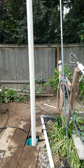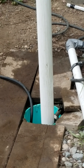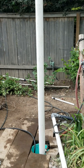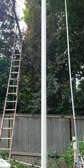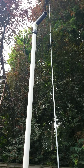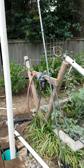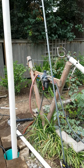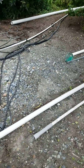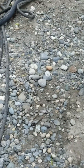So this is the general setup. You can see the well there — it's got a ten inch casing and I've got a three inch PVC that's a 40 foot pipe right now with an angle on the top to shoot out away from me. Got all the fittings there. So I'll turn the air on at the switch and then I shoot out into this area and you can see what I get out is a bunch of gravel and sand.